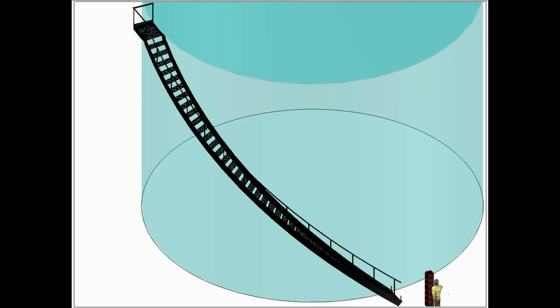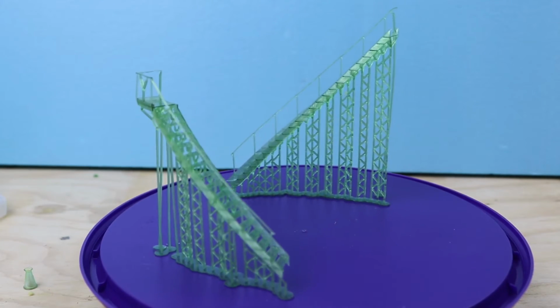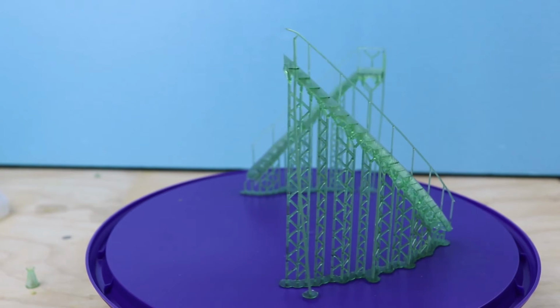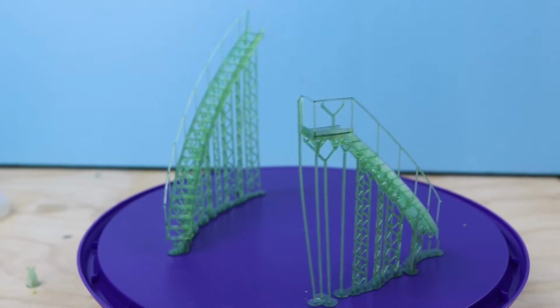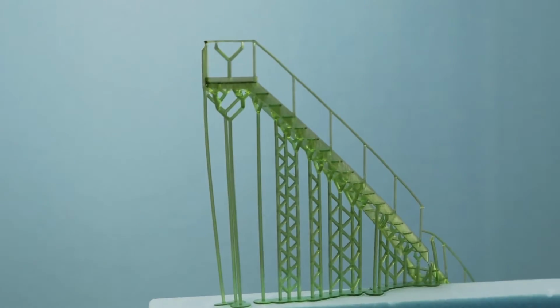They're just not available as an accessory, so I thought that's an ideal thing that I can design and then print. Now obviously the size of the tank that I want is something like 300 millimeters in diameter, and unfortunately my printer is not capable of printing anything that big. So effectively I designed them, then cut the model up into two pieces and printed them out at the same time, but as two items that can then be joined together later. And to be honest, I used the auto support function so that you can print them in the middle of the air, and it's been very successful.